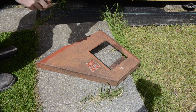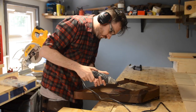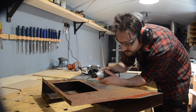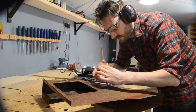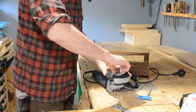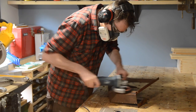The next thing that needs cleaning up is the dust chute. It's got a nice identifying plate on it but the screws are tapped into the sheet metal and I could not budge them. I let some penetrating fluid sink in but still no joy — these are just old slotted screws and there's not much to get a purchase on. So unfortunately I had to bust out the fake Dremel tool and cut the heads of the screws off. To remove the rust I've got this quite aggressive-looking wheel from Tool Station — I've never tried one before. It's meant to be good for rust and should remove it without removing any of the metal like a flap disc would. It's a bit like a scouring pad, just a bit firmer, and did a really good job of removing the heavy rust without damaging the metal itself.